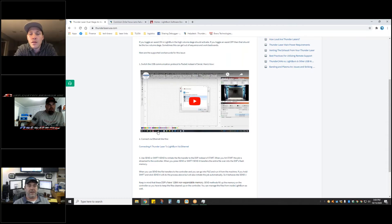The whole dual air assist setup is there because a lot of people want to engrave and then cut without doing two different processes. If you use a lot of air it makes your engraving look bad, so you turn your air down to engrave, and then when you go to cut you turn it up. With dual air assist it does it automatically — it'll switch from low for engraving and then switch over to high for the cut part.